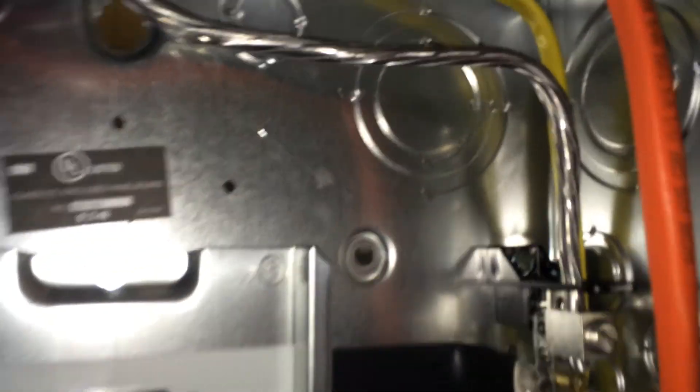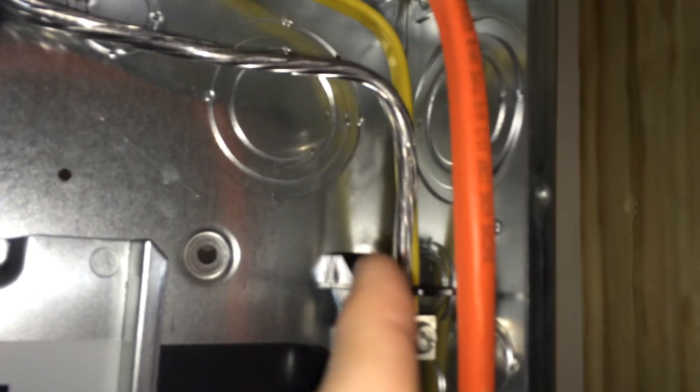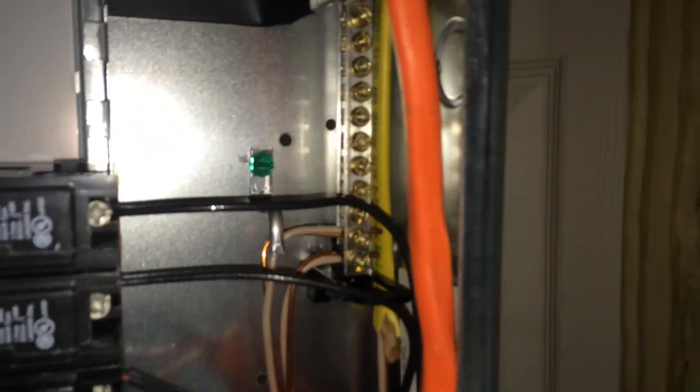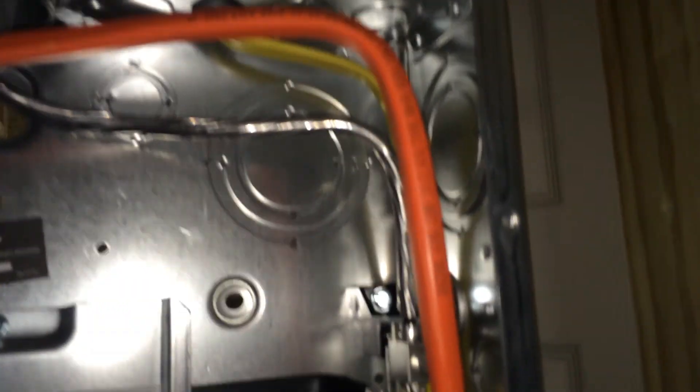I did want to point out a couple of quick things while I was here. You'll notice the yellow wire — that's Romex. These are both Romex, actually — this is 12-2 with ground Romex. I leave the jacket on even while it's inside the panel; it helps me to better identify later which hot and neutral go together. I also try to make sure the panel is neat, clean and tight so you can trace wires out. It's easy for anybody to come through and see where a wire goes. Another good thing about leaving jackets on is you can write on them so people later know exactly where they came from.